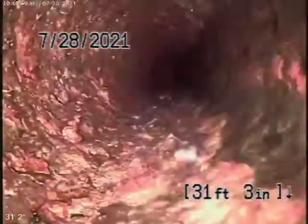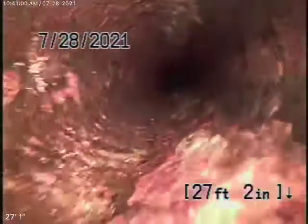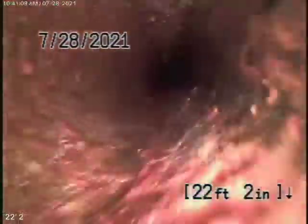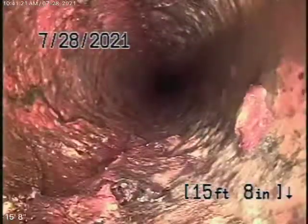The cast-iron pipe is definitely getting a little old — no doubt about it. This is where the other bathroom ties in, and then it comes all the way across the house. The pipe has a little bit of rust build-up, but by no means the worst I've ever seen. It's functioning — there are no roots or breaks, and it doesn't look too bad. We always recommend you never flush tampons, baby wipes, paper towels, or things like that. You do have this clean-out in the event of a blockage. Obviously it's old, and if the general inspector checks underneath the house and sees it's leaking, that's a different story — because remember, we're looking at the inside of the pipe; we don't see the outside.